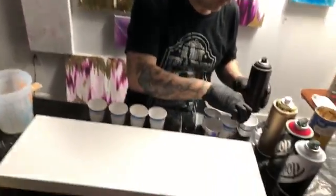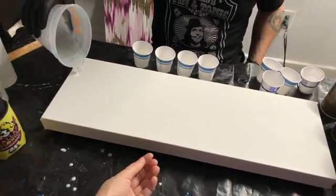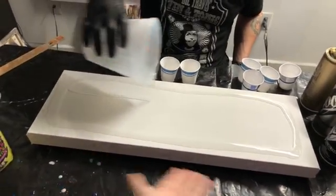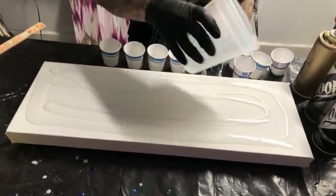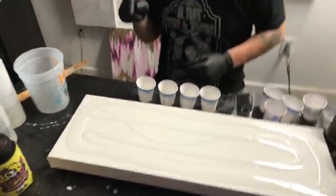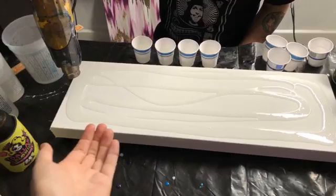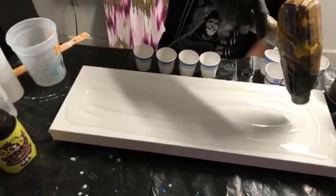The drips under the board, sometimes we'll tape it off and then pull the tape off 3 hours into the curing process, and that will eliminate the drips. If we forget and go to bed and the drips harden, you can use a heat gun to heat it up and an X-Acto blade to cut it off. Speaking of a heat gun. Oh, it's right here. And lastly, if it sets too long, you can always sand it off. Be careful though, because this happened to me last time I used the sander.